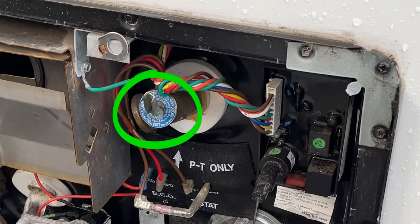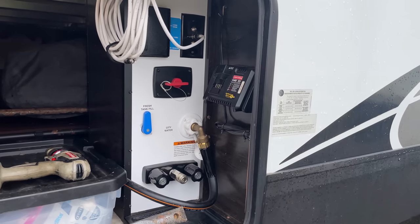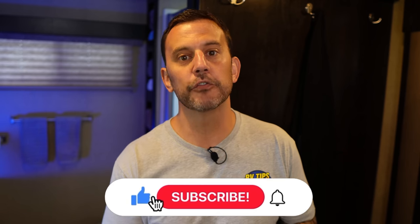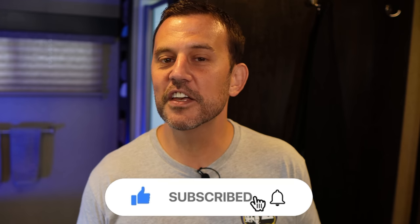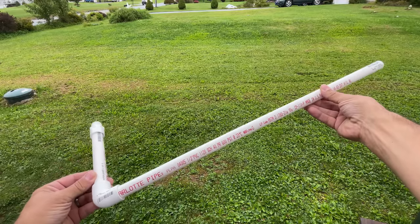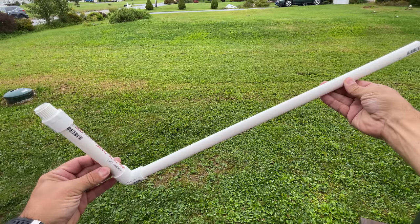Remember your T&P valve should be open while you're introducing your solution. Now it's time to introduce our cleaning or descaling solution. I have a six-gallon water heater tank so I'll be using six gallons of distilled white vinegar. There are a couple of different ways to introduce the solution into the water heater, and they mainly depend on what type of wet panel you have — except for the method we're using today, which is universal. Nothing needs to be done at your wet bay or to the valves on your wet bay, and this is why I like this method: it's easy, anyone can do it. All you need is access to your water heater drain. To get the solution into the tank you'll need to make one of these fittings — it will only cost about four dollars in parts from your local hardware store.